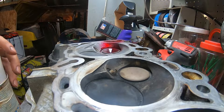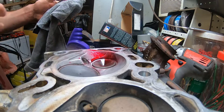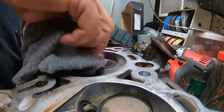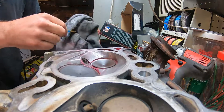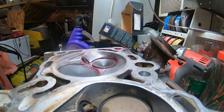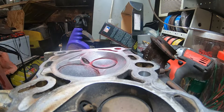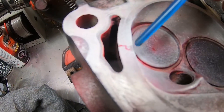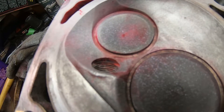Step one complete, now I've got to wait 15 minutes. The can says minimum five, so I left it for 15. This is a cleaner — you do not want to spray this directly on the part, you want to wipe it off, because you want it to stay down inside that crack if there is one. The last step is the developer. It's white and you want to stay about a foot away, give it a super light coat, then start watching for a crack. It's obviously clean here and I don't see anything. There's a tiny little dot right there but I don't believe that's a crack.